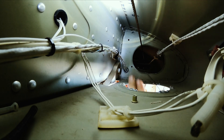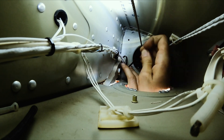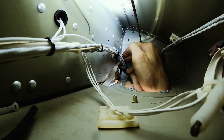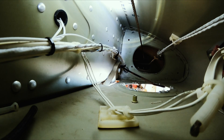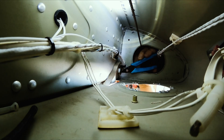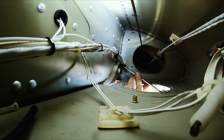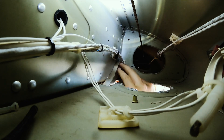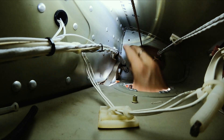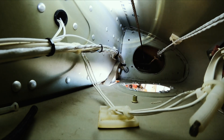Got another finger in there — you do need another finger just to set it up, then you can pull it through and tighten it down. You don't want it crazy tight, but enough to prevent rubbing and chafing — and hopefully no drilling through lines later if you ever have to do any other installs where you blindly drill into things. Here I am installing another zip tie plate just to make sure it's secure before it passes through the grommet in the sheet metal. Using these clippers from Harbor Freight — they are amazing, the best zip tie clippers ever. I highly recommend you find them and buy them. They are cheap and nothing beats them — not even Snap-ons.